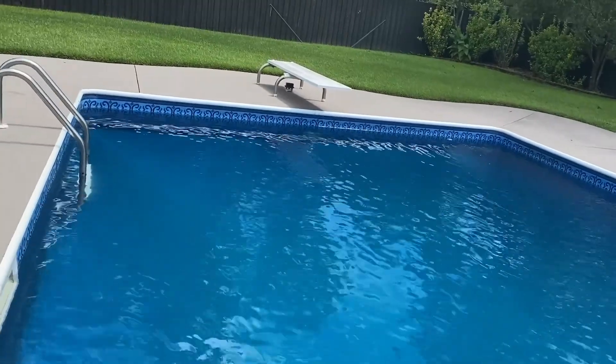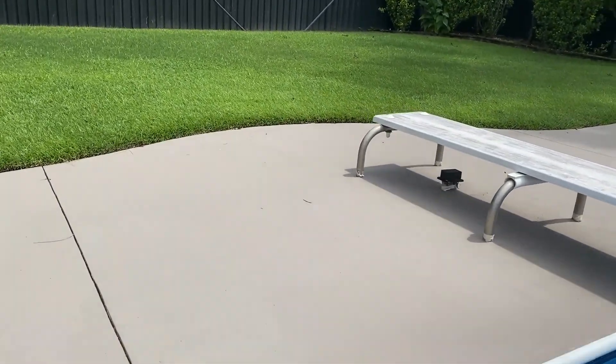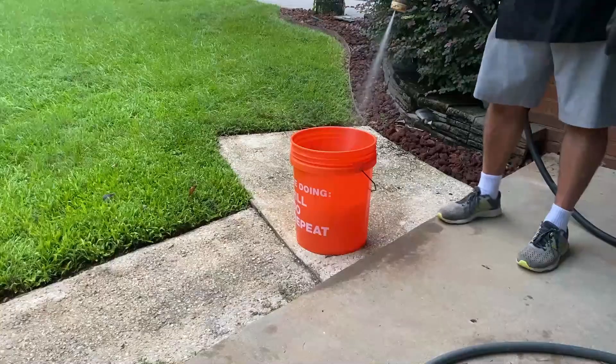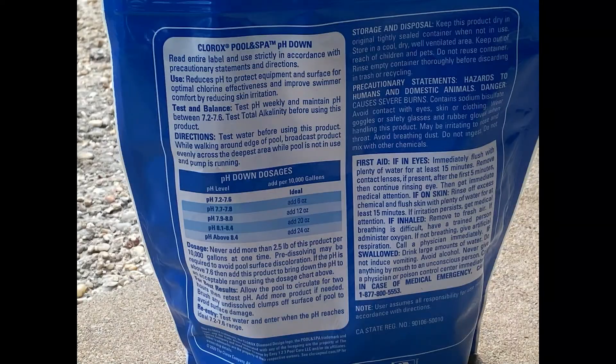In order for my pool to operate efficiently and to keep my family safe while they are swimming, I will need to ensure that the pool's chemistry is within its recommended ranges. Before handling any pool chemicals, it is recommended to always wear safety glasses, protective gloves, and to protect your clothes from bleach. Always fill your bucket halfway with water first, then pour in your pool chemical, and then mix. Always read the manufacturer's label for their recommendations and warnings, and never mix two chemicals together, which could result in producing dangerous fumes or possibly an explosion.